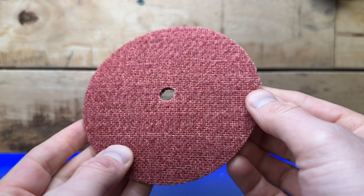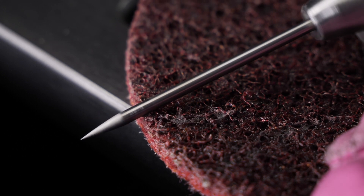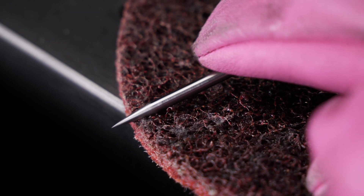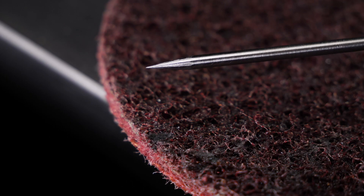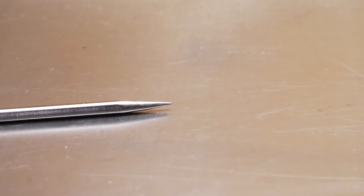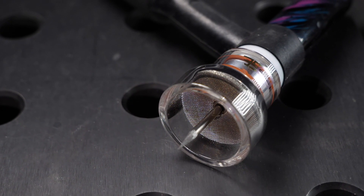If you want to get the best results out of your grinding, get a 3M Scotchbrite grinding pad. Place it on your table and, wearing all of your safety gear, spin your tungsten over this pad with a drill. Even though you're spinning this with a radial direction, the abrasive isn't coarse enough to put any real grinding marks in the tungsten surface. It only takes a few seconds with hardly any pressure. Looking at the final results, things turn out pretty smooth — the grinding marks from whatever method you used are removed. Everything we're looking for is as smooth as it can be. As far as tungsten type, I use the CK Worldwide laser tungstens — these snap up and arc on really smoothly with pretty good control at low amperage particularly.